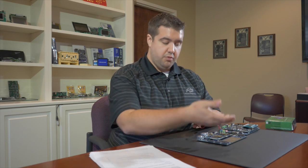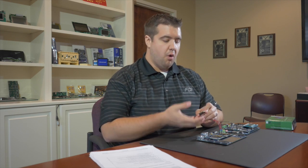One thing to note: when you're done testing power consumption, disconnect the ULP hardware from the board and reattach the jumpers for your 3.3 analog, digital, and battery. This allows the board to be programmed and used normally, because power consumption will be affected if you've got the connector hooked up while trying to program the board using the on-board J-Link.